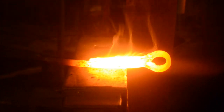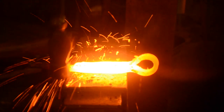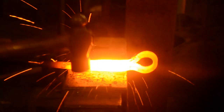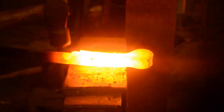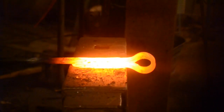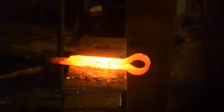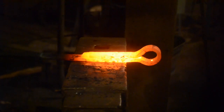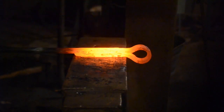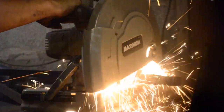The sparks that fly from the metal during the forge weld are molten borax. It's important during this stage to make sure that you've got nothing easily flammable nearby — proper safety equipment is also crucial. My safety glasses have got a couple of globs of borax melted into the lens. You want to forge down the billet to about half of its original thickness; by this point it should be forge welded pretty well. A pretty good rule of thumb is that you've got three heats to make it stick — by which point if the weld hasn't taken there's probably too much gunk in the middle for you to fix it without taking the whole thing apart. The last half inch did not take so I'm just going to cut it off. I don't have much confidence in the weld so I'm using a chop saw rather than a chisel — this is easier on the seam.